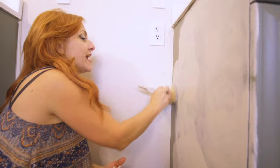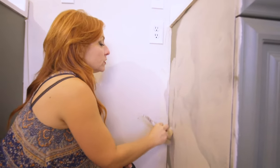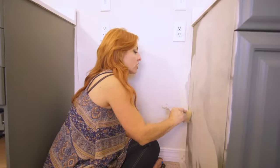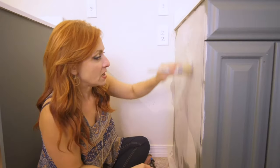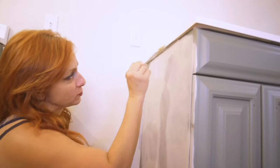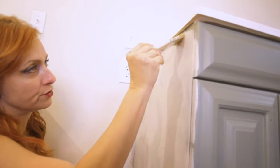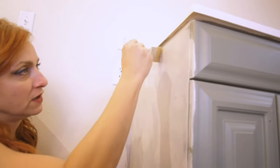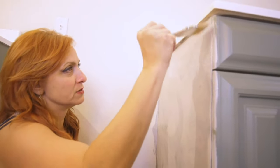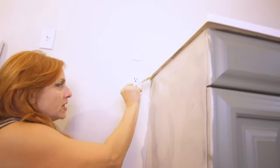We've got two-inch tape here — I love two-inch masking tape. It works really well because it's wide enough that the brush isn't going to hit the wall. Now for the detail areas, this is where I use this little chip brush. I'm just dipping into the paint a little bit and then cutting in. Whoever painted this before got paint all underneath here, but if that wasn't the case it would be important to be really neat — just cut in with this little brush right here.